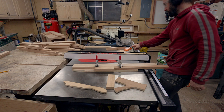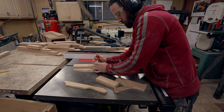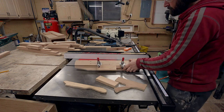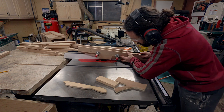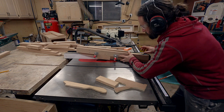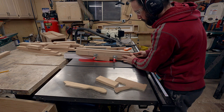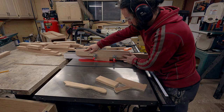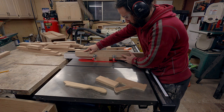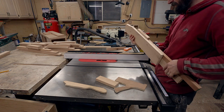I try to avoid getting my fingers close to the saw blade, so I use a jig from a previous episode to hold small pieces down — this keeps my fingers far away when I cut the groove. I move the fence over 3/4 of an inch to accommodate for the jig's thickness and repeat the same steps. You have to be really careful doing this. If it hits the saw while it's spinning up it could kick back at you, and you have to be really gentle and slow. In fact, I make a mistake — I don't wait for the saw to completely stop spinning before moving the piece, and it kicked back. Word of caution: be careful.